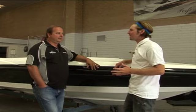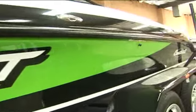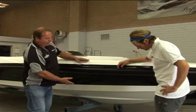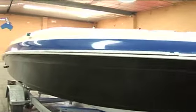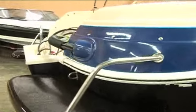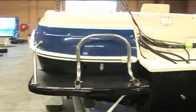Now, getting down to the graphic side of things — what would be the different graphics between a ski boat and a wakeboarding boat? What we're looking at there is the gel coat styles. On a ski boat where you want the boat to look fairly slim and fast, you'll stop your colour above your chine level, which gives the whole boat a sleek look. If you're after a wakeboarding look, which is a lot fatter type, you bring that colour all the way down to the chine and it makes the boat look a lot heavier. That's exactly what we've done with the Wake Life boat — the colour had originally stopped about three inches up and we actually brought the colour right down, and you'd notice now the boat has transformed and looks very heavy.